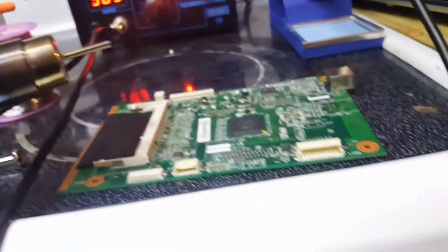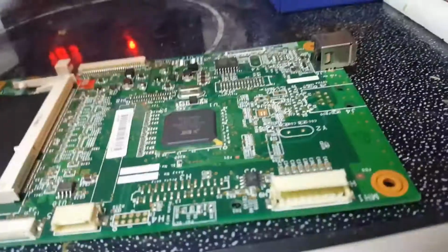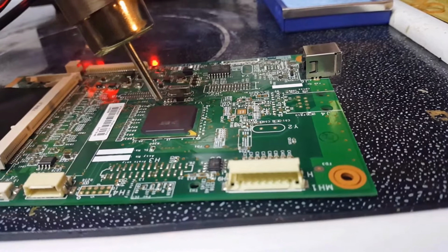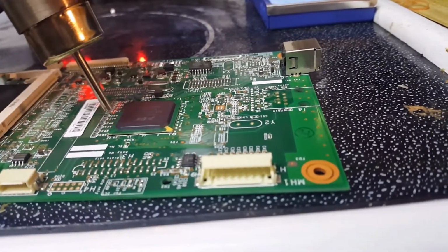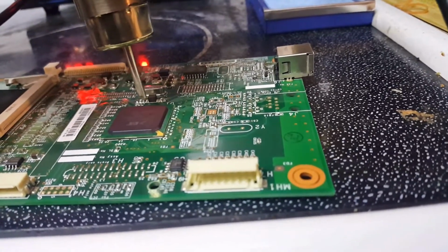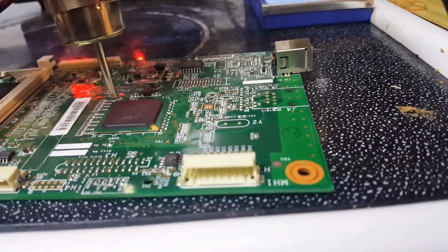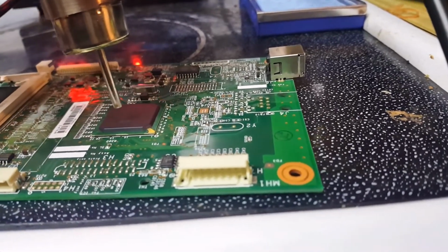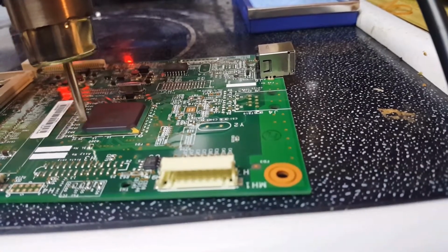Yeah, whoa! I can sign my name on the styrofoam. So what they said to do was to roast it nice and good for about 10 minutes, or until you touch the chip and it moves. That means the solder's moving, or fluid, I guess. I guess it's better to do straight down. What I need is one of those infrared temperature sensor things that goes up to at least 205 degrees Celsius. It doesn't quite move yet.